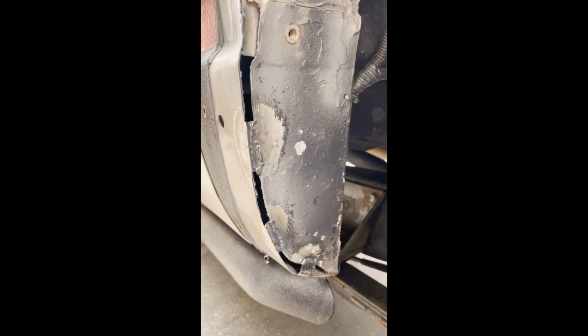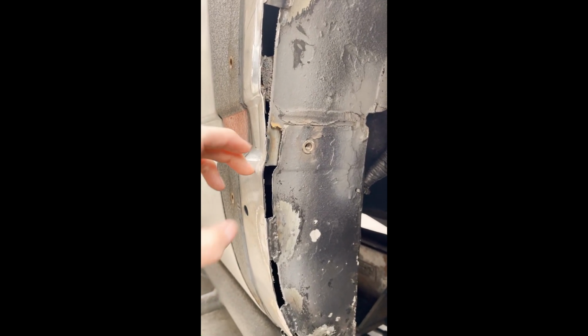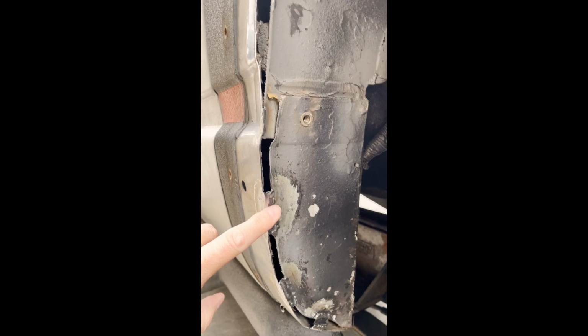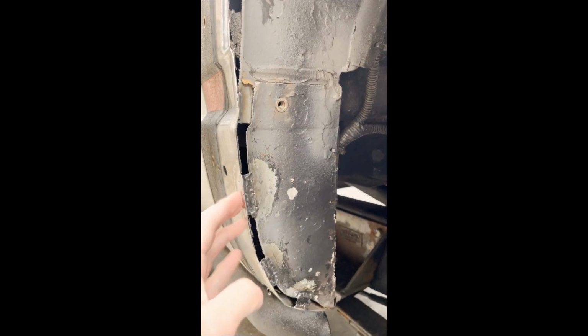I had the wire speed wrong, the heat too high, so dial the heat down and wire speed up, and I start getting those results. Much better. I'm not fully closing this up. I'm just putting tabs in place that hit everything, make them solid. These two pieces were close enough together. I just zapped right there. Stitch there, stitch there, stitch there. Now it makes all of this solid again, all of this solid again.